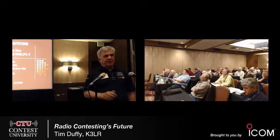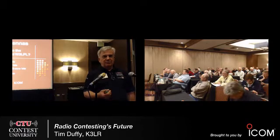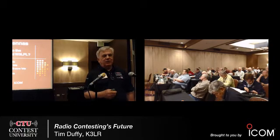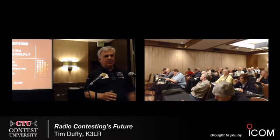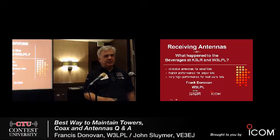About four or five years ago, W5ZN, Joel, and N4HY wrote an excellent paper about short verticals. It's on Joel's website, W5ZN.org. He had very detailed descriptions of how well that antenna performed compared to his beverages. I took even more interest but didn't act until two years ago, when I built one of Joel's arrays for 160 meters. I immediately asked myself, why did you wait so long? The performance of Joel's eight-element array — originally W8JI's design — is just like using a five-element Yagi on 160. The beam width is about 45 degrees, and side lobes are down 20 dB all the way around the compass. It's absolutely amazing.